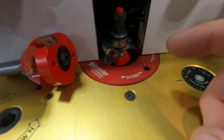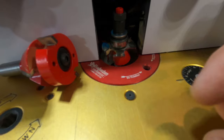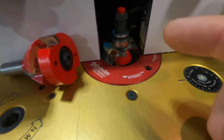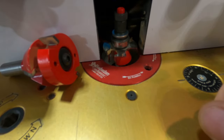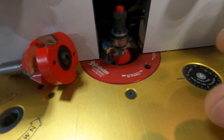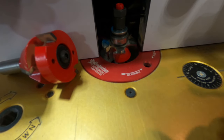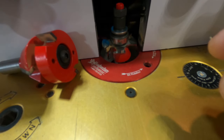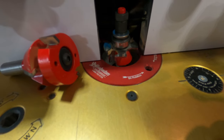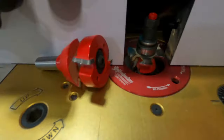To cut the profile into the stiles and rails, I'm using this Freud router bit set. It comes in as 2 bits, 1 and 2 right there. And what's nice about this is it's an adjustable set. You can adjust the depth of the groove for a different thickness of panels that you have. And that comes really handy. In my case, the panel that I'm using is a little smaller than 1/4 inch. So I was able to adjust it for the perfect gap.